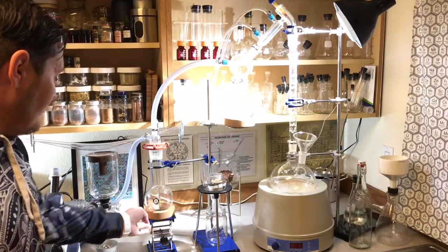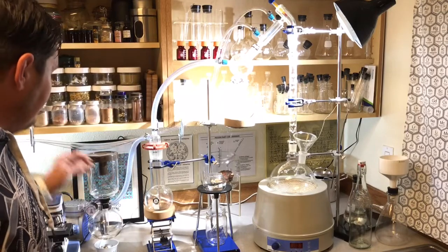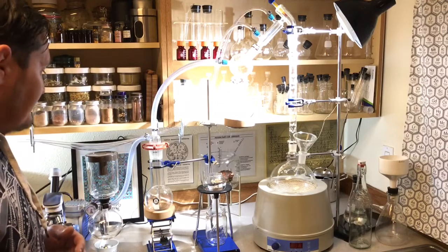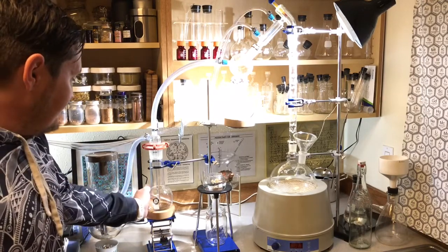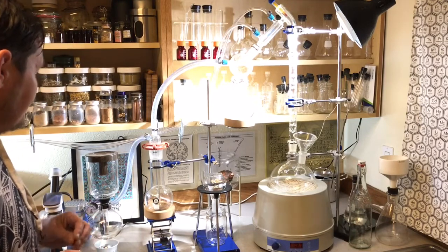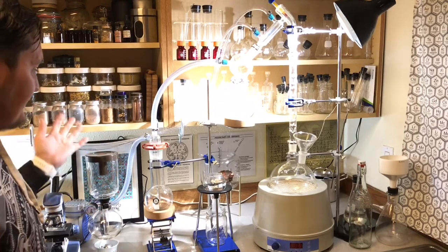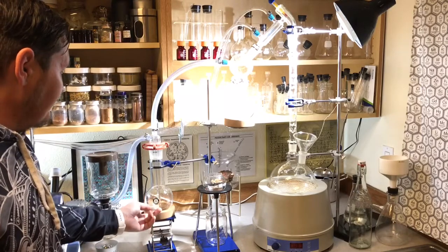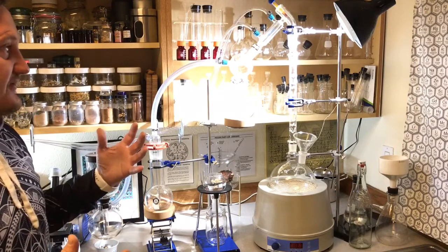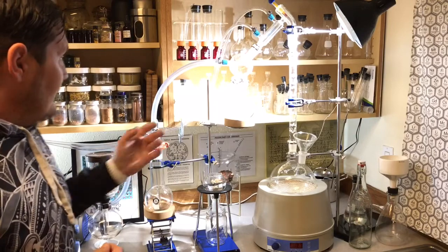If this were in operation, we'd have some dry ice. The function of the cold trap is to keep the vacuum pump cool — we run the whole operation under a vacuum. To keep the vacuum pump cool we use this cold trap, which prevents any moisture from getting into the pump. Any moisture that comes down immediately freezes to the bottom here instead of going into the pump.